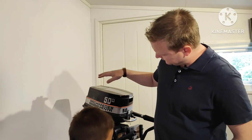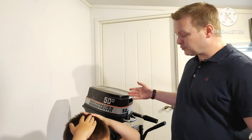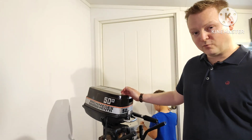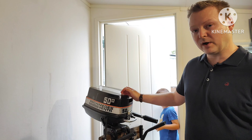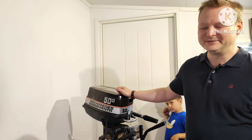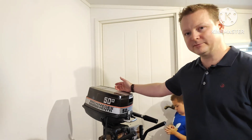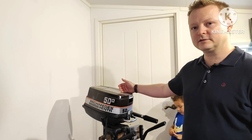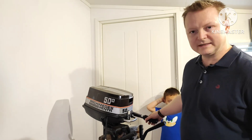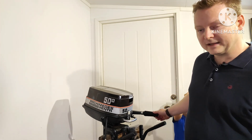We're going to work backwards — look at the prop shaft upward, figure out if we need an adapter box, put the motors in, then test the motor drive. Before we can test drive it I need a power source, so we're going to start building the 81-volt battery pack. We'll go into all the challenges, how I calculated things, how we'll try to overcome those challenges with different engineering techniques. Then we'll connect it all, do trial runs, and hopefully optimize further — like shunt modding a controller to get even more current into the motor.